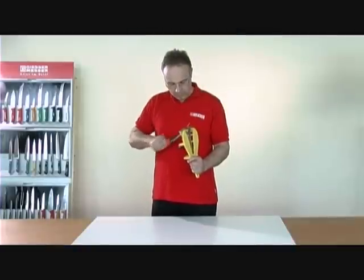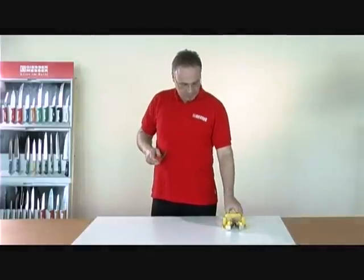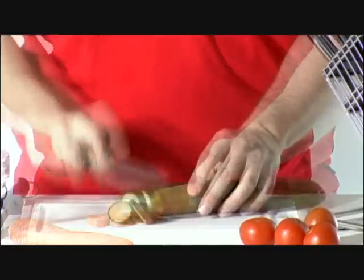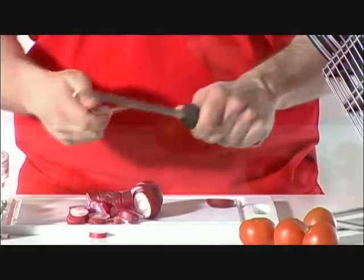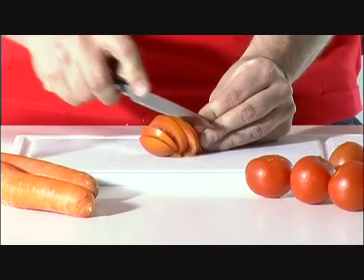With a Sharpen Easy, it is also possible to restore a cutting edge that has been more seriously damaged. The blade end is again placed in the knife sharpener and drawn through to the V end several times in a smooth, regular motion. But even the best cutting edge becomes worn with heavy use. Every cutting edge becomes increasingly flatter with abrasion, grinding and sharpening. The microscopic burr disappears. The edge becomes blunted and cannot be restored with a sharpening steel or tool alone. The knife must then be re-ground by machine. Worn cutting edges reduce productivity and mean increased accidents at work. So knives must undergo regular regrinding.